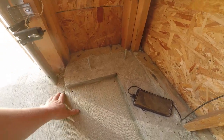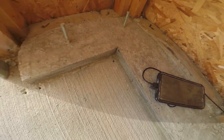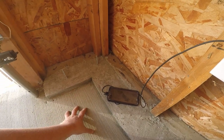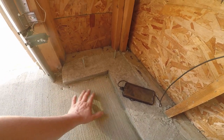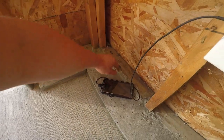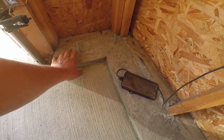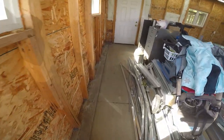We used light gauge steel angle. We pin-bolted it down with 3/16" pin bolts — very tiny pin bolts. The track itself was an inch and a half. The sill plate here is treated wood, also an inch and a half thick — we just wanted to bring it up a little because it's minimal leakage. If you have more leakage you can go higher. We caulked the inside of the plate all the way around with Trim-Clad, then did the concrete. We're going to use a foam gasket for the steel stud bottom plate and then caulk it all again with poly.